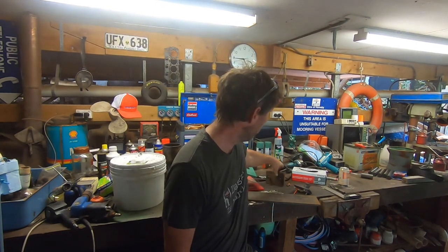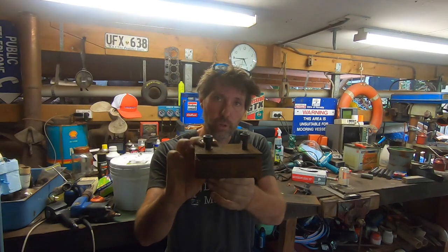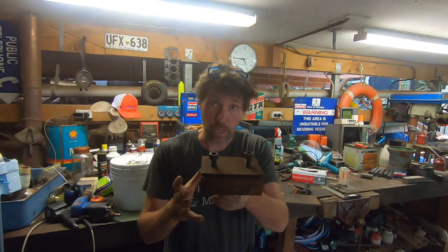What I'm doing is converting from the original engine mounts that were cast bits of chock-fast orange. So you make a formwork, get it in the right position, pour the epoxy in, it sets, and then if you need to, you shim it slightly. That's how it was done originally.